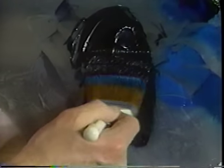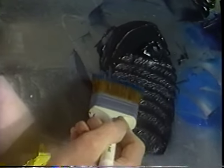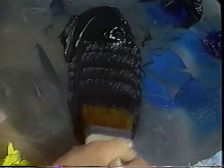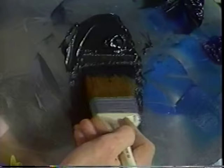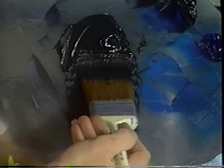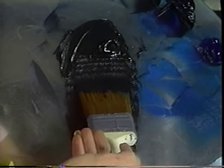It doesn't matter, I'll use a two-inch today. Pull it through the paint, wiggling it. See? Wiggle it. Other side, pull it through, and wiggle it. You need a lot of paint in the bristles, just like with a one-inch brush, to bring it to a nice, sharp, chiseled edge. Wiggle it — that loads the bristles. And by wiggling it and pulling it, it pulls the paint toward the end of the bristles and sharpens it, just like you would a knife.